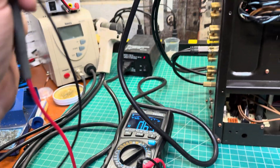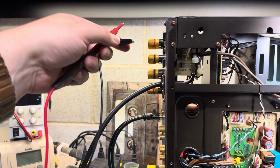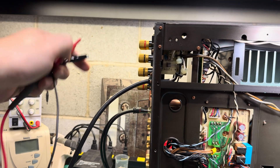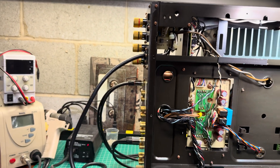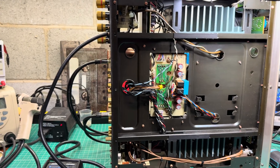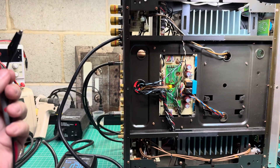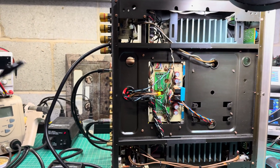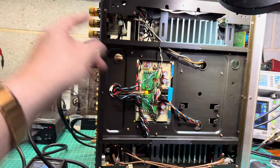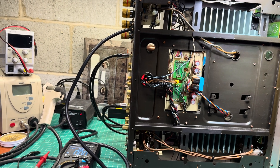Next I'll use an AC voltmeter to check if there's output on the speakers. So far the speakers look to be connected because there's only a minor 50-millivolt DC offset. I tested it with the AC voltmeter and I observed up to 15 volts AC on each channel — I didn't turn it up fully — and I can see a clean waveform.